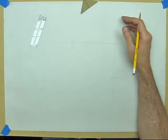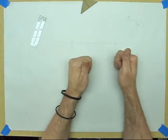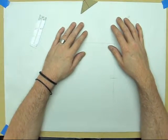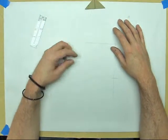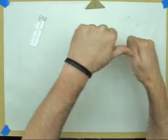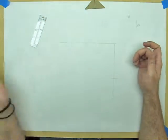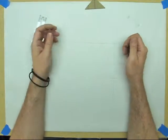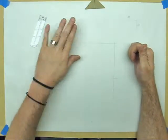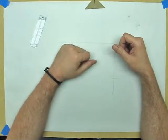One of the problems you're going to find when you're measuring inside your case, or you're just trying to eyeball it, which I would obviously never recommend, is that the tube is round, there's lots of different light sources, it's just ripe for optical illusions. What's going to happen, and I speak from experience, is you'll put the bend in, if you're eyeballing it or freehanding it, and you'll go put it back in the case and it turns out it's about 3/4 of an inch too far this direction. So you cut that off at 1 inch off, and then you come back, and now you've gone too far. It's a 1/4 inch too far the other direction. So you heat the tube back up and bend it, and pretty soon your tube's kind of wobbly, and it's just not real precise. It doesn't have that real crisp military precision we're looking for.